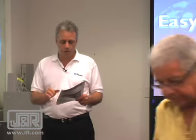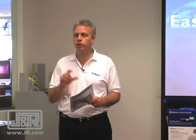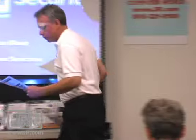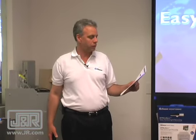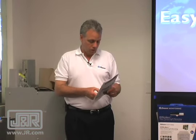You now record by images per second and compression quality. For example, if you want to record someone handling cash at a business, then you want to record at a frame rate that's high enough to be what we call real time, which is in the range of about, let's say, a minimum 20 to 30 frames per second. Then you have a video compression quality, a good, better, best. Say we record at normal, and we record 1 image per second on a 120 gig hard drive. You are going to get 2,330 hours of recording on the hard drive.